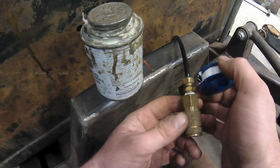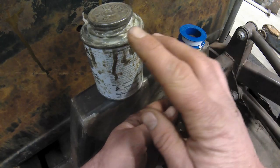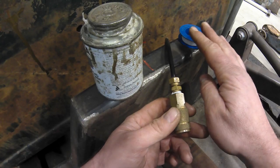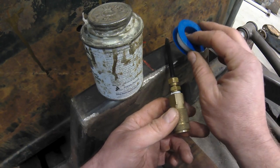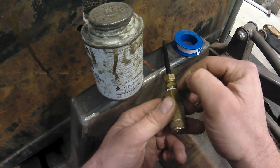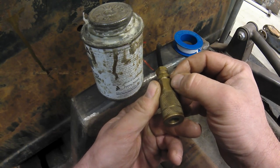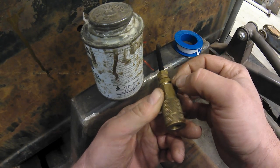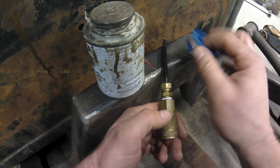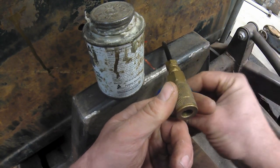I use Teflon tape — I'll wrap about two times, then I'll add a liquid thread sealant over my Teflon tape, and then I'll cover my liquid thread sealant with another thin layer of Teflon. I've had really good luck doing that, but make sure you keep your thread sealant out of your inside airway passages. You don't want that stuff blowing downstream and getting lodged in your valve. Remember, Teflon tape is directional — you've got to wrap the same direction that you're tightening your fittings.